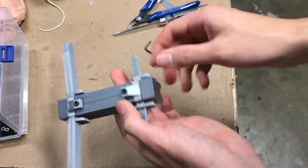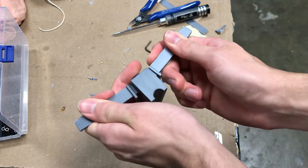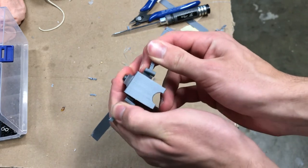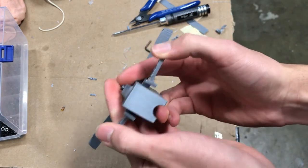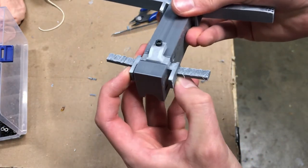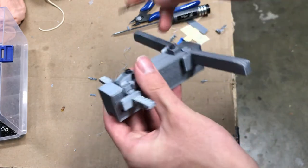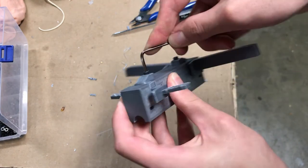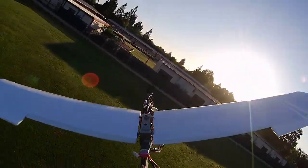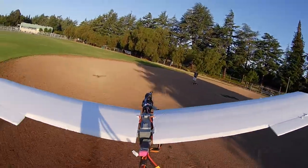I had a couple of minor complaints about the 3D printed parts. One thing I didn't consider was slop, or backlash. Due to the small size of the printed parts, my tolerances weren't super great, and the wings suffered a lot of flex. The relatively small wing inserts led to unwanted yawing within the mount despite the ramps I'd included. My 3D printer isn't perfectly dialed in, and even at a very fine 0.08mm layer height, some parts still didn't turn out how I wanted. All that said, the PLA plastic holds up surprisingly well, and the spar system is surprisingly robust for its small size — it survived several crashes without any catastrophic failure.